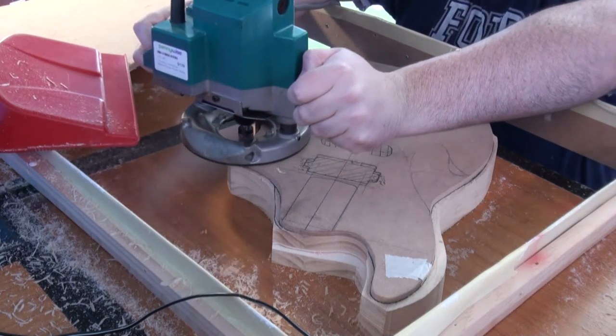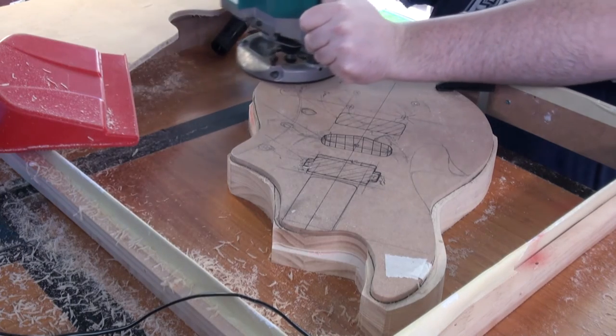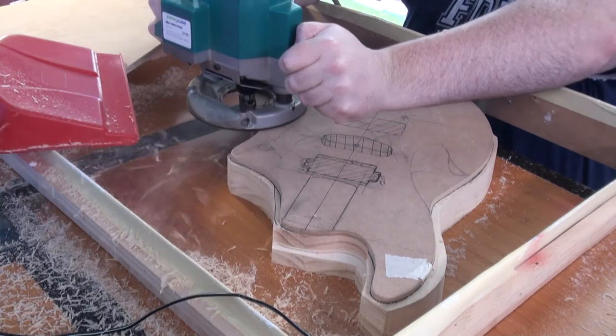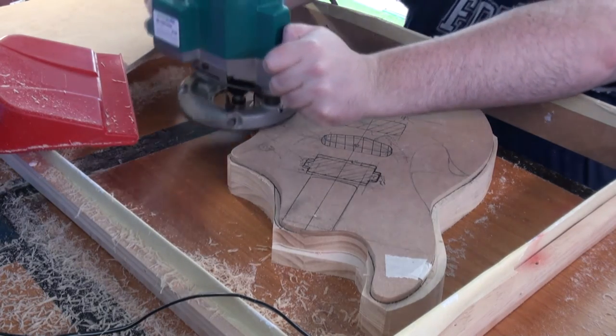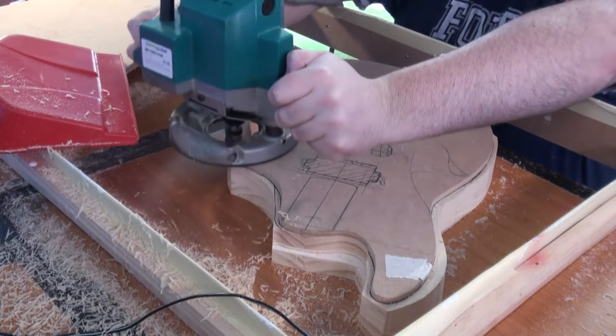I bought a 25mm and a 45mm bit because I knew that I would have to trim the sides back in two rounds. The smaller bit to take down the top half running along the template, and then the second would run along the first cut to complete the bottom half.